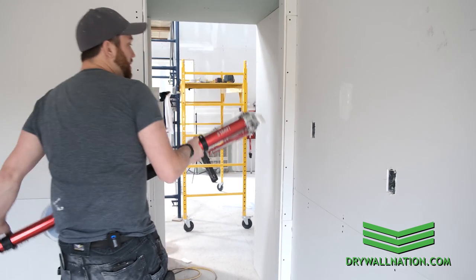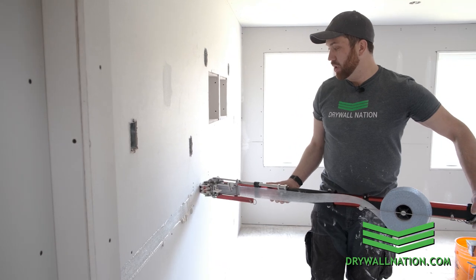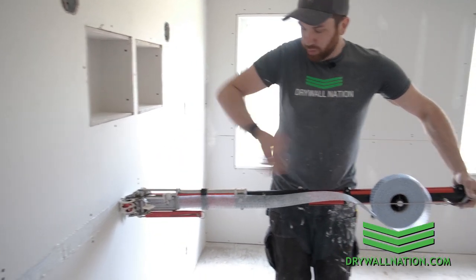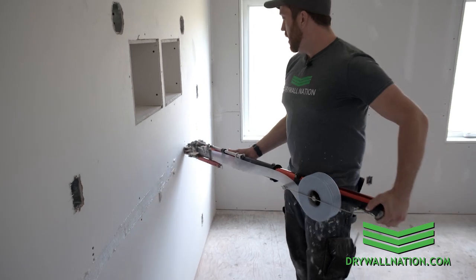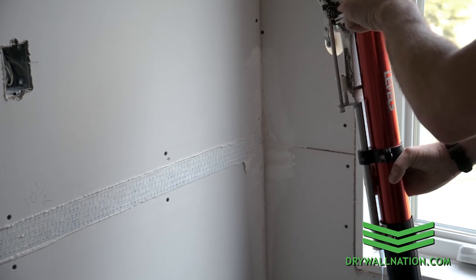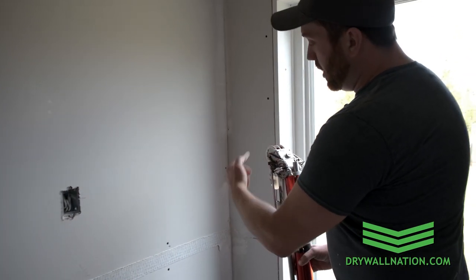You can see I have a few inches of lead tape so it doesn't short me on the wall. As we start moving forward, you want to lead with the automatic taper. As soon as you get a little room away from the wall, run it on an angle so you're leading with the taper head — you don't want to hold it perpendicular trying to walk backwards. Get it on an angle so you're leading with the head and can comfortably walk sideways. When you get to the corner, cut your tape about three to three and a half inches short because your cutting blade is set back, so it'll seem like you're cutting short but by the time you roll out that extra two inches you'll get right to the corner.